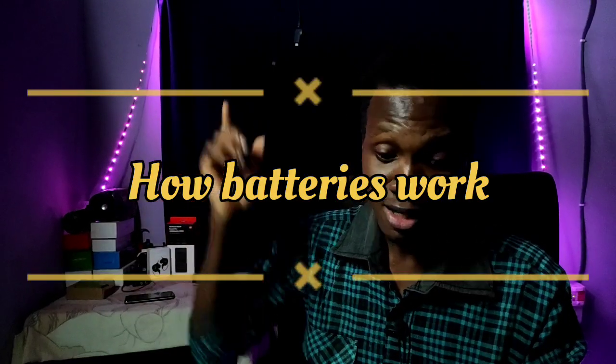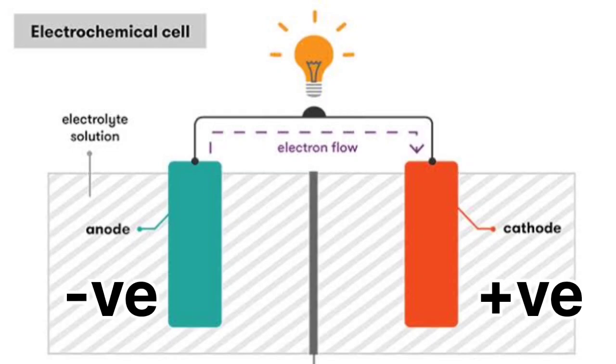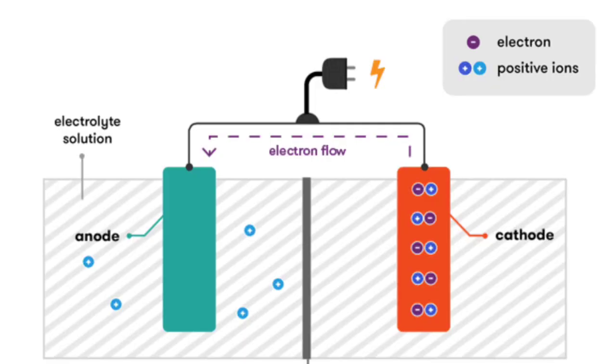All lithium-ion batteries — whether lithium-ion or graphene — all work the same way. The battery is divided into two half cells: one side is positive, one side is negative. The current is stored on the negative side. When you connect the battery to a load, electrons stored inside the electrolyte paste escape out of the negative part, the anode, power the load, and come back in to the positive side, the cathode. To recharge, you reverse the polarity by plugging in a charger, and all the electrons flow back to the anode. It's a reversible redox reaction.